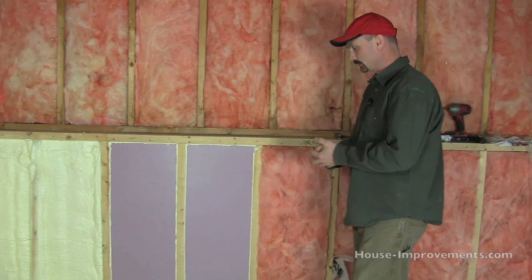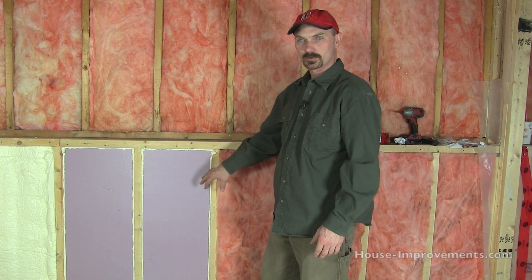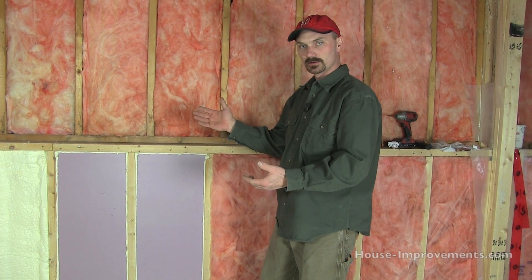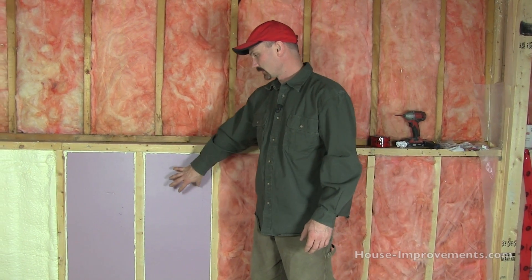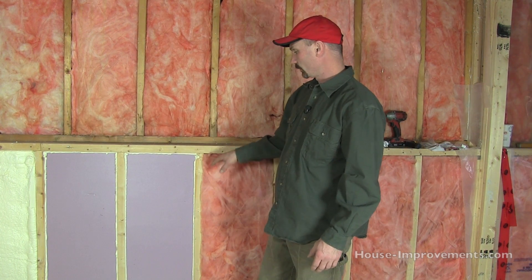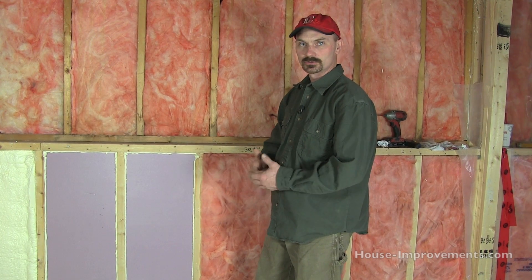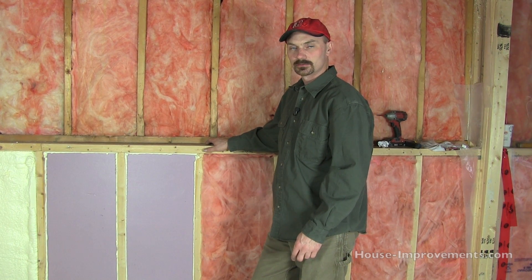You could do a bit of a hybrid type situation if you've got a thick enough wall. A lot of times I'll use a one-inch styrofoam as my moisture barrier in a basement right against the concrete, then frame the wood wall and insulate it with batt insulation, and then put vapor barrier over top of that. That gives you a thermal break between the concrete and the wood completely. This also gives you some R-value — even at an inch, I think it's an R5 for most of them. And then with your batt insulation, even if you have two by four walls, you've got another R10. So you could be up to an R15, which gives you a pretty good finished product.